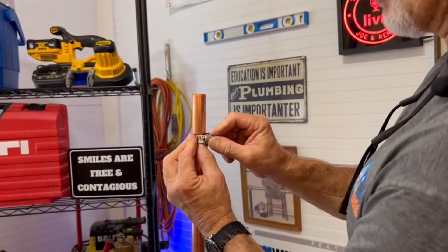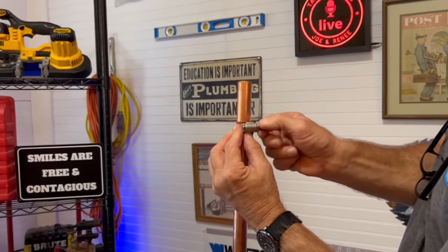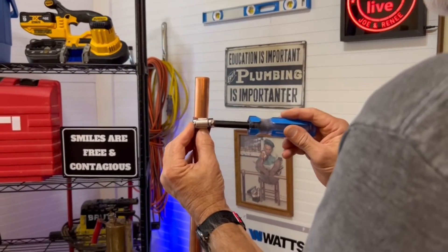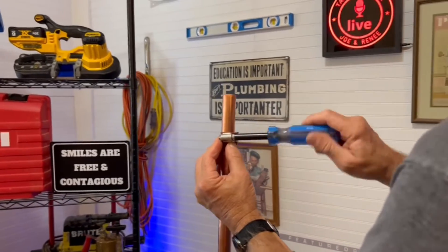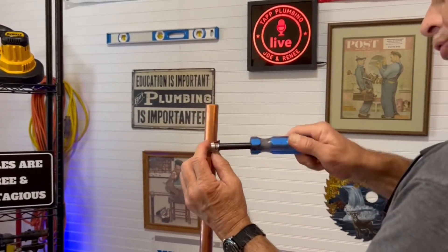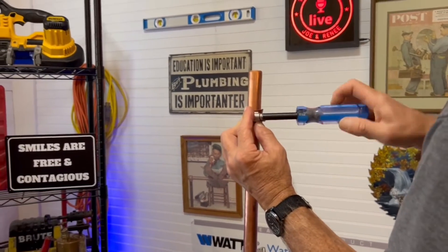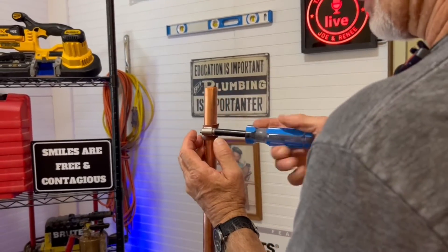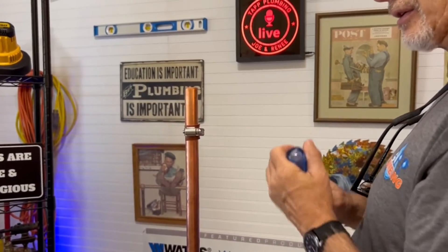Get the screw started back into the band — just get it where it's going to go back together for you — and wind it down. We're going to leave a link in the description so if this happens to you, you can get your water turned off. How to turn off your water at the meter. In a few minutes we're going to talk about a different way to fix this, but this is pretty simple. You just wind that down until it's tight, and that's pretty much all there is to it.